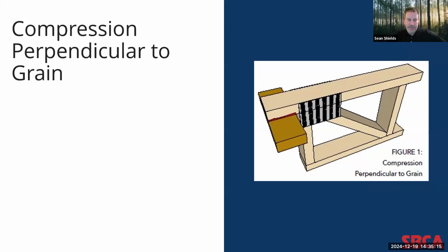significantly affects this check. And when you think about lumber quality currently in the US, there is a significant amount of wane that exists in dimensional lumber produced by lumber mills, which makes a lot of sense. And structurally, there's a lot of allowances for this, but in this particular application, it's important to consider the impact of wane on the bearing location. So ANSI TPI 1 2022 has included a wane factor, or C wane. By strictly prohibiting wane in the extended chord region, so setting C wane as 1.0, a substantial increase in bearing capacity can be achieved.